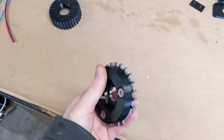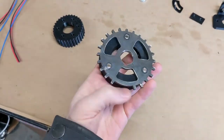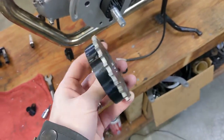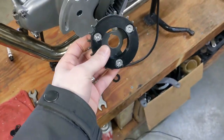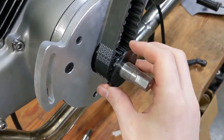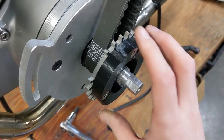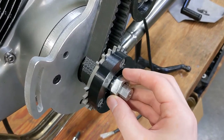So I was talking earlier about our trigger wheel, and this is our actual trigger wheel — it's a 24 minus two teeth and it just goes on our lower spindle. This plastic part is just a timing hub for us to put timing marks on and allows us to indicate where the engine is in its rotation. We need a spacer first, then our trigger wheel slides on there, then another spacer, and then our nut.